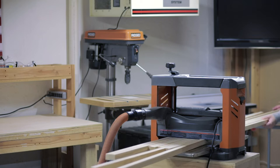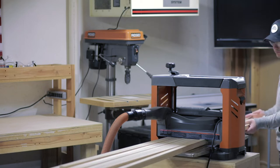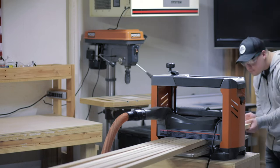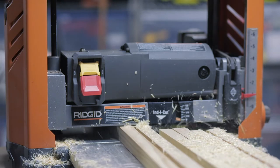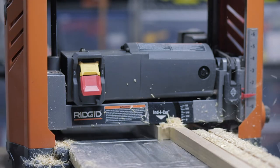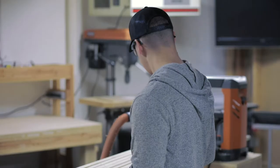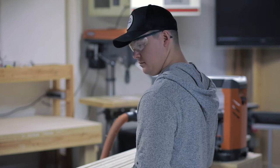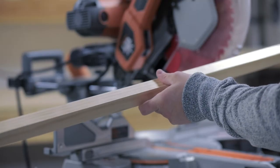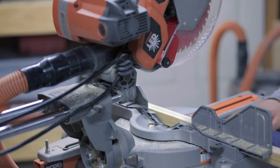I also wanted to make sure that I didn't make the stands too thin — even though they may have looked nice, the risk of warping would have just increased significantly. If you don't have a planer, this whole step isn't all that necessary. You can probably do a great job squaring up your material on the table saw, or you could just go out and buy a nice straight piece of stock that's already milled to square. I do get a bit of snipe on this planer, but I didn't bother trying too hard to minimize it. I had to cut these strips down to their final length anyway and could cut off the two or three inches of snipe on each end when I made that cut.